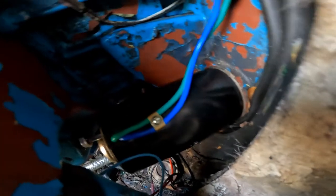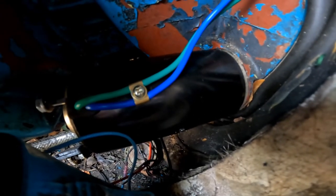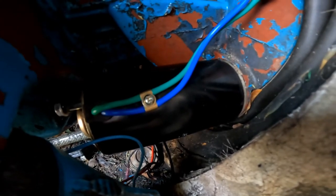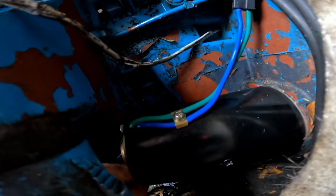I've got the bolts started and the motor fully set in — it wasn't too much of a struggle. There's a tine on the end of the motor shaft, so you want to get that tine lined up either vertical or horizontal in a specific orientation, and then get the motor lined up the same way. Otherwise you're fighting it and the three pieces of the motor all fall apart. It has to sock into the intermediate drive, so it's got to fit right or it's not going to go in.